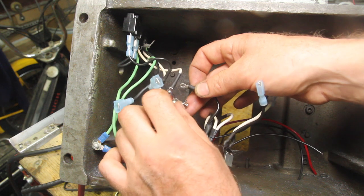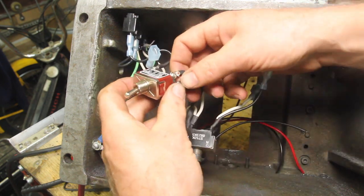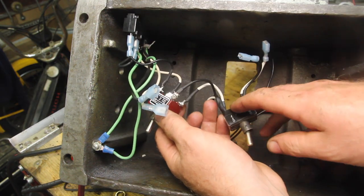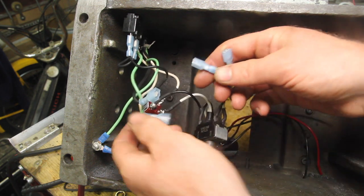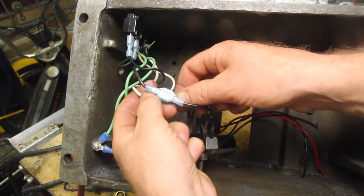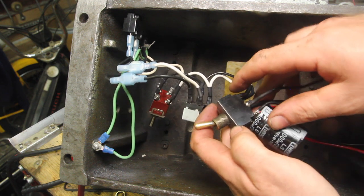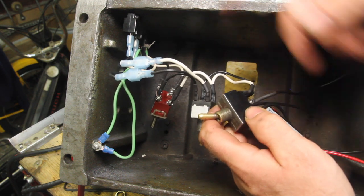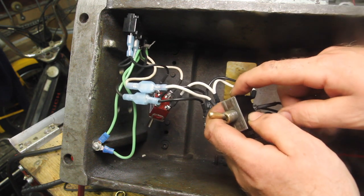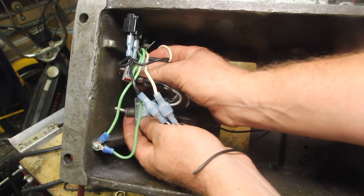So the switch for the motor is going to get wired directly onto the master switch here. So the wiring runs from the master switch to the motor switch, and then from this side of the motor switch runs to the motor wiring. I also continued this wiring on to the demagnetized side of the magchuck switch because that flippy floppy bit with the northy southy parts is exactly what you need if your part has become mildly magnetic. If you expose it to that, it will scramble up all the magnetized parts and you'll get rid of that residual magnetism. So all this buttoned up here.